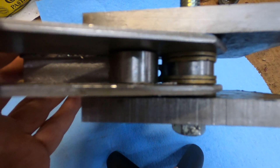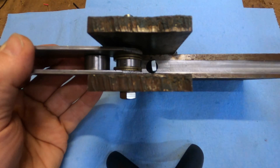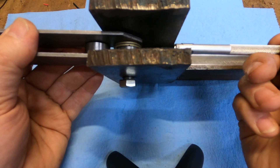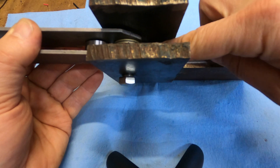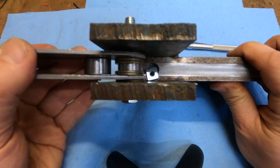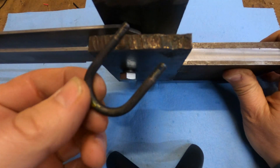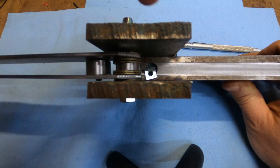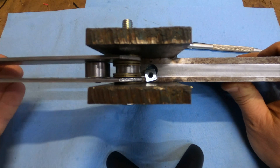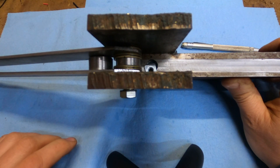Down in the back, to hold the stud in the right place — so it's all cut to length and threaded first, this is the final operation — there's a square nut which sits in a 9/16 hole. This square nut holds the end of the threaded rod exactly where it needs to be so that when forming, the stud can't pull away. That way I can set the thread depth once I figure out the leg lengths desired, place the part into that nut, and through a little trial and error figure out exactly where it should be placed and form it. Any fine adjustments to the final shape I could do at the arbor press to get them perfectly to the customer's tolerance.